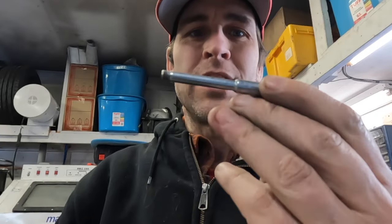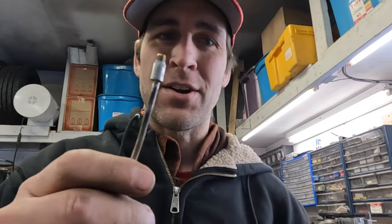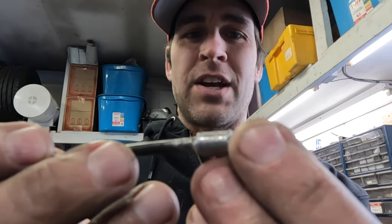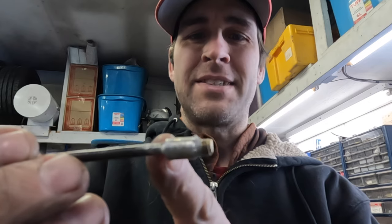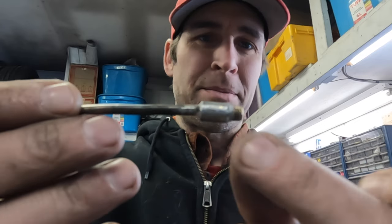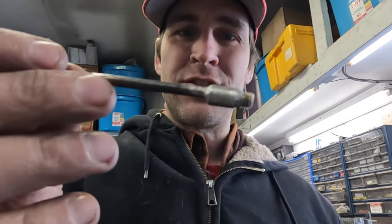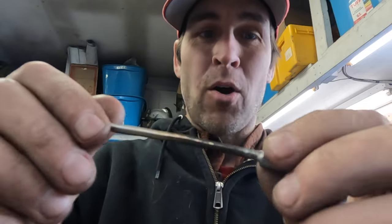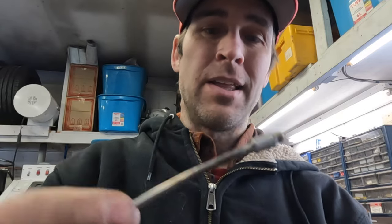This last fuel pipe unfortunately was way too big — it was hitting the fan — and so I've had to come up with something else. I've got a brass connector from a jet ski electric solenoid and I've cut a bunch of it off. It was threaded for M6 in the end and it has M6 protruding from the end. The fuel line is stuck into an M6 thread and I've soldered it in there. I'm hoping that the solder holds.